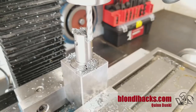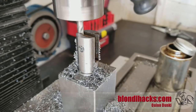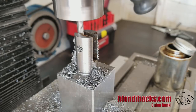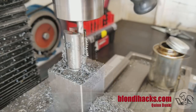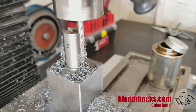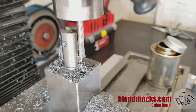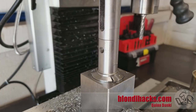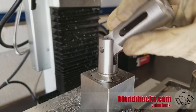I'm using an extra long end mill here because the slot is pretty deep. I could have milled this part horizontally, but I wanted a square bottom in the slot mainly for aesthetic reasons — if I milled the slot horizontally it would have a rounded end from the profile of the end mill. Truth be told, a rounded profile would actually be stronger, since a rounded fillet on an inside corner is always stronger because square corners create stress concentrations. There's a quick test fit and it's looking really good — you can see how it'll hinge once those ends are rounded over.